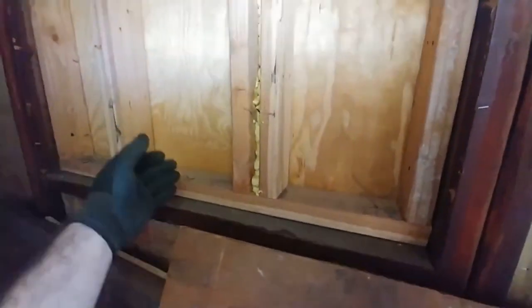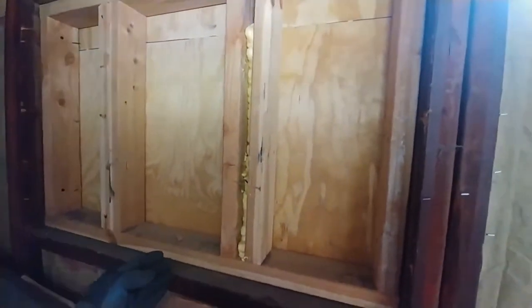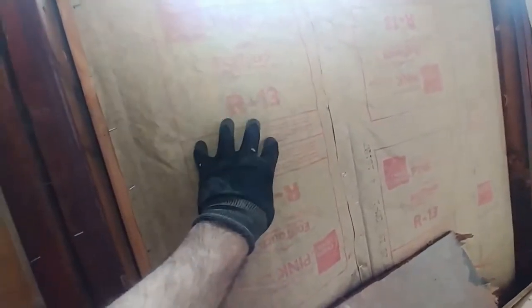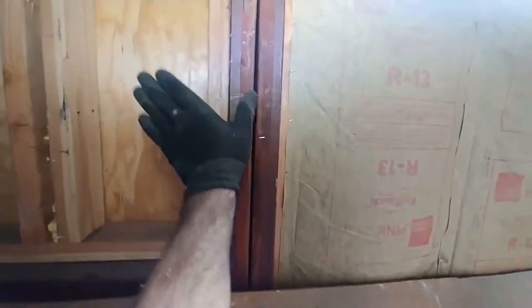So if it had been me, I would have just stomached, you know, doing at least some of this out of 2x6, the major surround for each space out of 2x6, and like bisect it once. And then if you needed to carry the plywood on the outside, send 2x4s in there. I don't know. Anyway, you should be able to just finish this. And I would have put Rockwool rather than fiberglass in, because you can get an R for the same physical size bat. You can get two more R's value. You can get R15 in there. And really, it would have been better, because R19 fiberglass will fit in a 2x6 wall, but I believe it's R20-something when you go to Rockwool in a 2x6 wall.